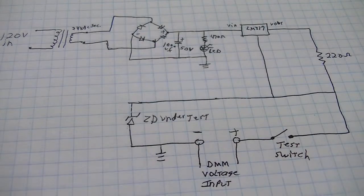That got me thinking I ought to build a quick, simple Zener diode tester. I started thinking about how to do it, went through some datasheets, and this is what I came up with. It's nothing earth-shattering — if you look on the web there are probably a hundred people who've done a very similar circuit. Basically you take the LM317 and turn it into a fixed current source, inject a voltage into it, and hook the Zener diode up to the output.